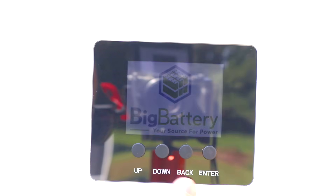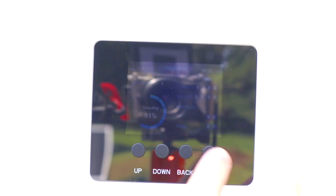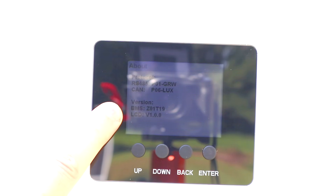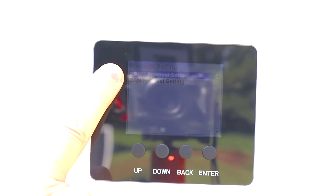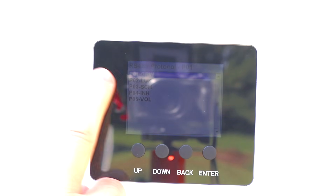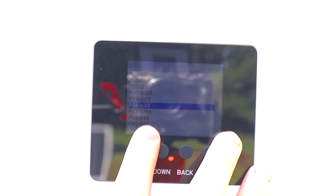Power on your BMSs and go to the front screen. This screen indicates state of charge, voltage, date, and all the other things you need to know. Hit the back button and we can see the protocol and firmware version. Hold down back for five seconds to access protocol settings — our RS-485 setting and our CAN protocol setting. We're going to go to RS-485 and scroll down to LUX, which is for the EG4, and hit enter. Then scroll down and set the CAN setting to LUX as well, so that whatever communication protocol we use — CAN or RS-485 — it will communicate with our EG4 Flex Boss.